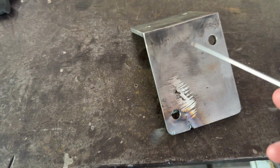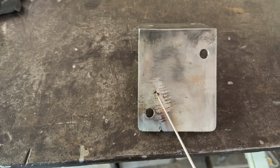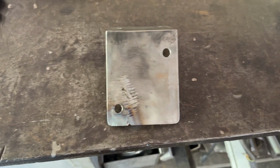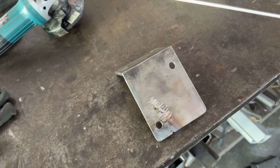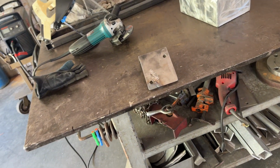My recommendation was to replace the whole thing instead of repairing it, because you don't know how pitted it's going to be, especially after we're done welding it. It could weaken it more and there could be a lot of pits inside. So if we repair it, we just can't guarantee it. It could last a week, it could last years, you don't really know. So I gave him a price. It was $30-40 to repair it and $100 give or take to replace it with type 316 stainless, but I can understand why he wanted to repair it.